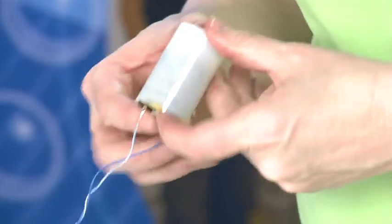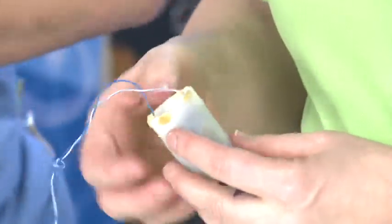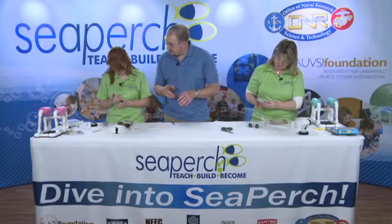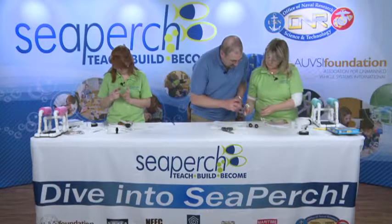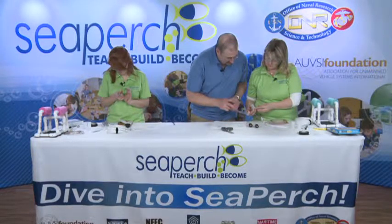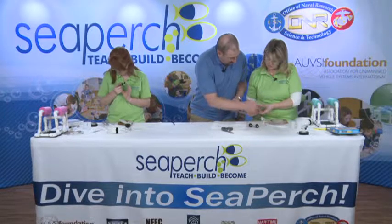Once it's in place, put your thumb and press and you'll see the wax kind of squish and seal itself right in the bottom. Get it in place — all you need to see is that bottom quarter inch where all the wax contacts. Don't be gentle. Now you see that seal all the way around the bottom.